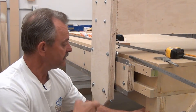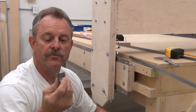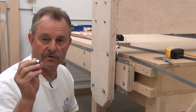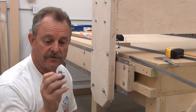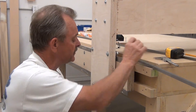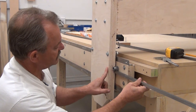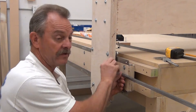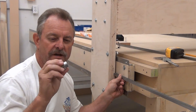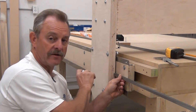I know the motor dimensions: it's a half-inch bore with a half-inch shaft that's an inch and a quarter long. This gear here is 3 thousandths shy of an inch and an eighth in diameter, so I can drill an inch-and-eighth hole all the way through to mount this to the motor first. Once the motor is in, you won't be able to attach the gear, so we'll need to put a set screw and/or a keyway in it. When this is mounted to the gear rack, it's seven-eighths of an inch from the face of the bracket to the face of the gear, leaving only about three-eighths of an inch — the hub itself — which may not be enough shaft engagement.